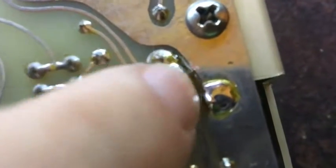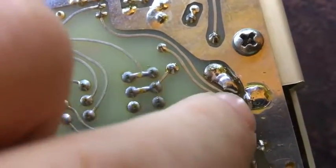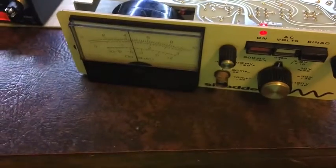I've cut that little trace and installed a capacitor in those two empty holes. So now that is floating for DC. AC measurements are still fine — it's not actually affecting that, it's all working perfectly.